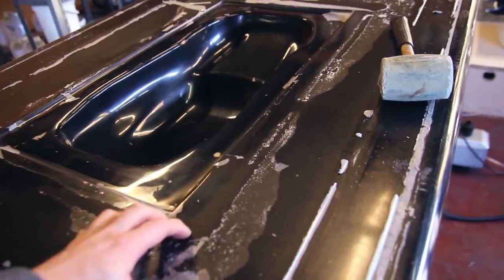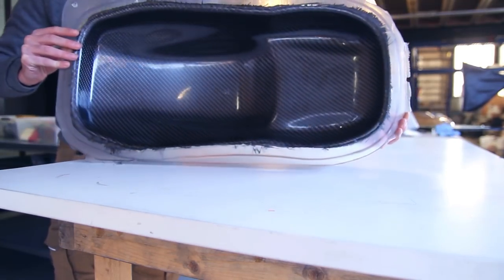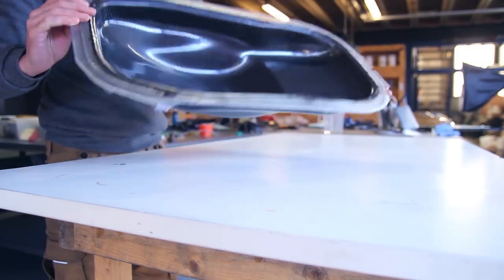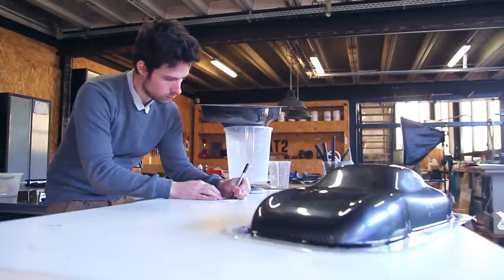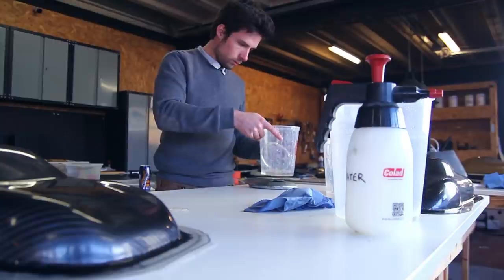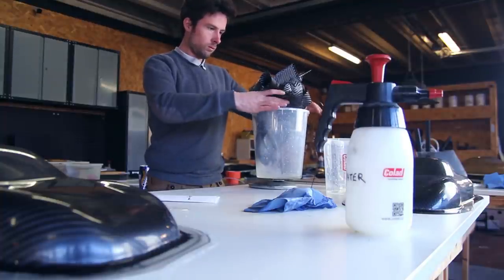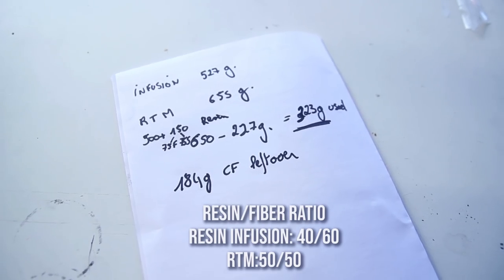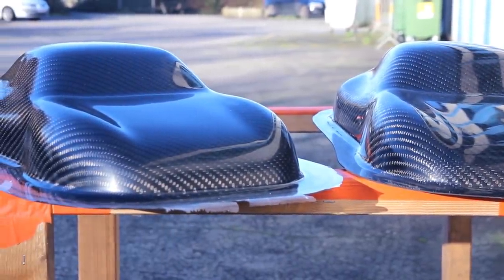For the rest, there's just some flashing around the parts — that can be improved too, and I have new ideas to solve these problems. But as you can see, the process and technique are working, which is why I call this a success despite the failures. We have a good finish on both sides — useful for parts that need to interconnect. Dimensions are stable; the infusion part weighed about 527 grams, slightly more because the resin perimeter is still attached. These parts are out-of-mold finish with no sanding done, so even better results are achievable. Early measurements suggest RTM gives around a 50/50 fiber-to-resin ratio, compared to 60/40 with infusion.